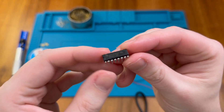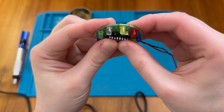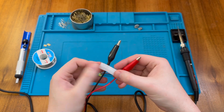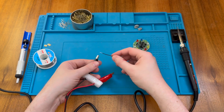So this is our CD4017. I think we should pop it in the board and see if it works. I've got my power supply here set to 4.5 volts. According to the directions it's a 5-volt board, but hopefully that will do for us now. So let's connect things up and see what happens.